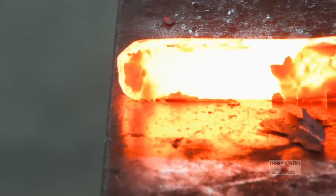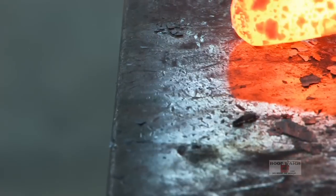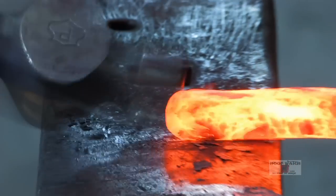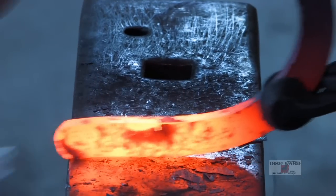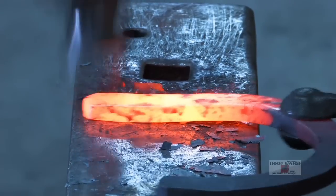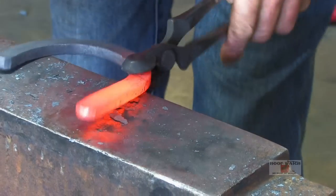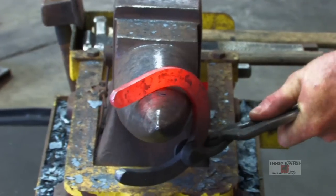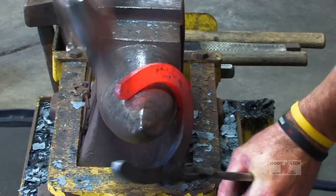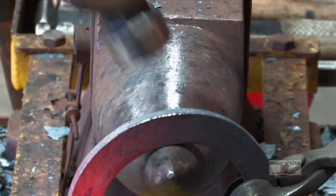All right, we're coming around the outside edge, and it's a hammer finished shoe, so we're trying to get rid of any kind of cold shut, anything that would make an unsightly mar on the outside of that branch. We only got one shot to make these heels, so making those as nice as possible. And bring it all the way around. So then we'll just come here. And I'm not gonna pinch hammer on horn, I'm just gonna go past.